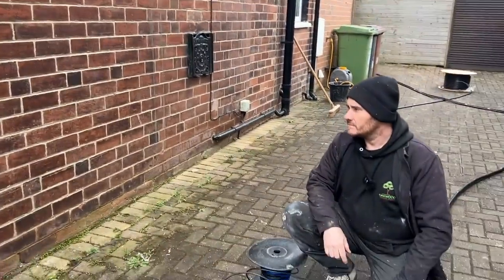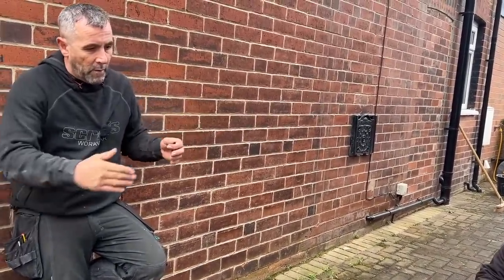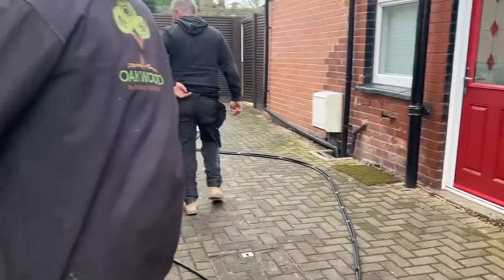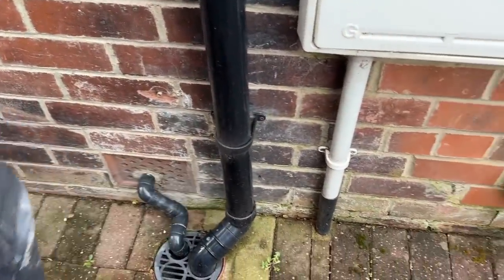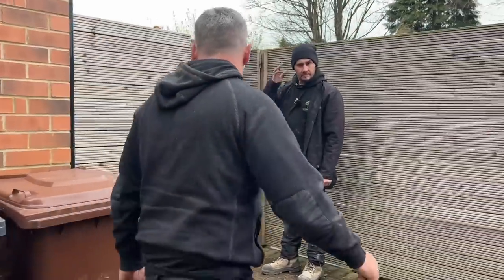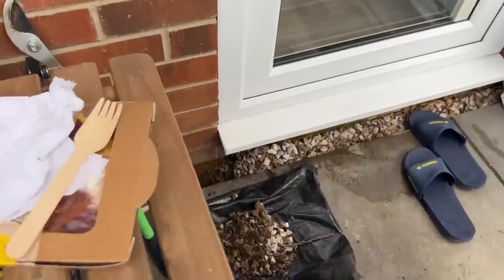We want to get the metal cladding on today, so we'll thread the cable where it needs to go. The power needs to get behind where that grey box is - that's his consumer unit. We don't want to lift the block pavement, so we'll clip it direct to the wall along that seam, punch a brick out behind the gas pipe so we can get behind it, mortar it in tidy. Then drop down into the gravel bed.